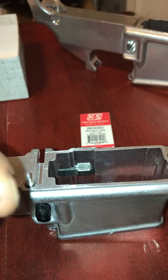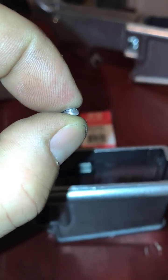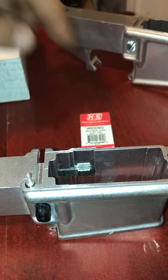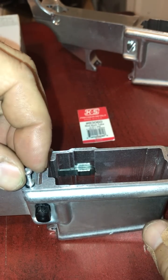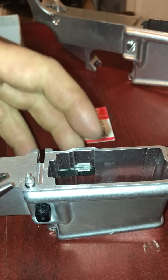Difficulty 3 is you make yourself a little ring right here. I just cut it off the 3/16 with a .049 hole that I showed you earlier. I just whipped it off on my mill. Oh, I'm sorry, on my lathe. You could do that with a Dremel. It's no big deal. The tolerances just really aren't that big a deal, because this isn't the firing mechanism of your gun we're talking about. This is just holding that magazine release button open.